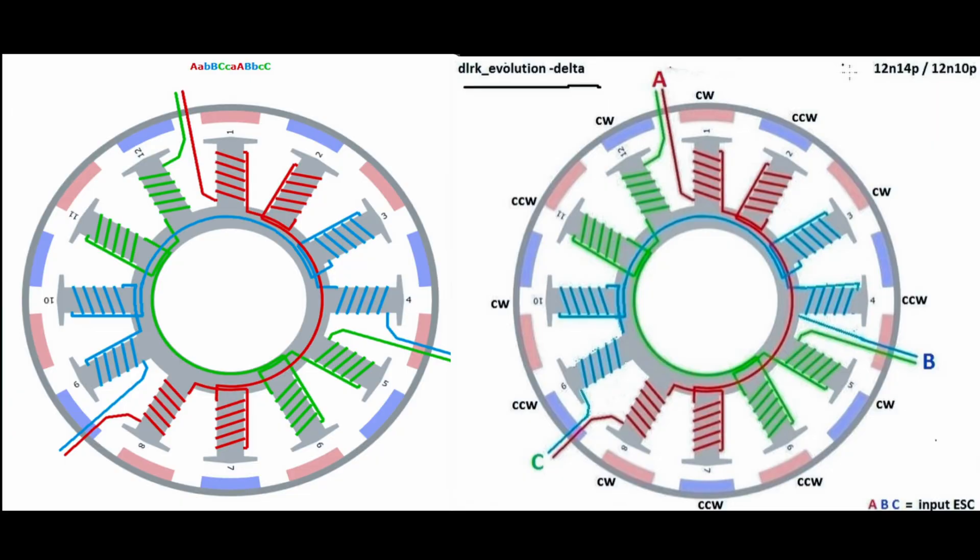The advantage of the winding scheme I used is that it makes terminating the windings easier and neater. If we take a look at this chart, we can see how the pattern and the scheme come together, and the gobbledygook of letters starts to make a little more sense. Each capital letter is a clockwise turn and each lowercase letter is a counterclockwise turn.